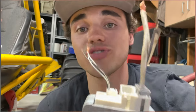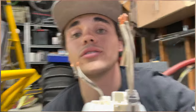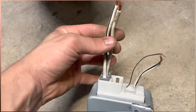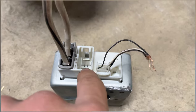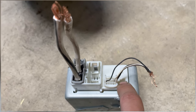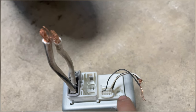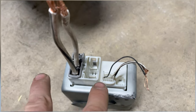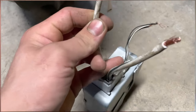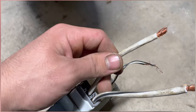This module is super easy to wire up — almost all the wiring is done for you when you pull it out of the car. These are the only wires you have to cut to get it out of the car. The rest — these two plugs — hook to the motor. There's a plug for the motor and then wires from the module itself that just plug right in. This wire here is your ground wire, and this one runs to your battery. I'm going to run an inline fuse with this and hook it up to my battery — I'll do a 30 amp fuse.